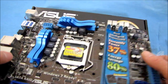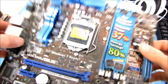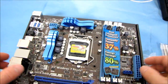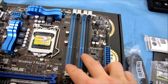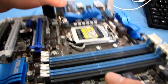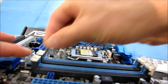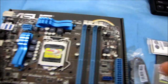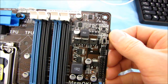We've got an 8-pin power connector and some nice wave-style MOSFET heatsinks around the CPU socket — they're nice and low-profile, so you shouldn't have any trouble with tower heatsinks. We've got four sticks of dual-channel DDR3 memory compatibility. This is the easy-install kind with only a clip on one side — you slot the memory in, open the clip, slot it in, and clip it shut. We've also got a MemOK button, which should ensure the board will boot with any memory, no problem.